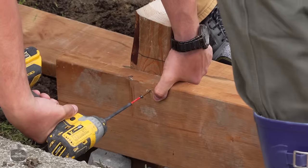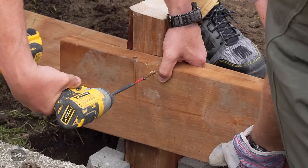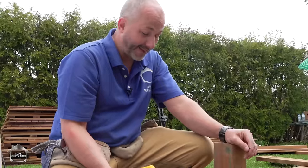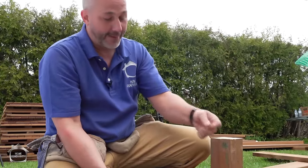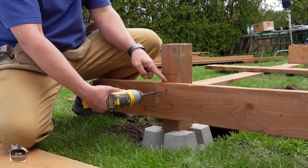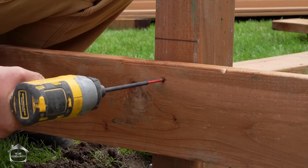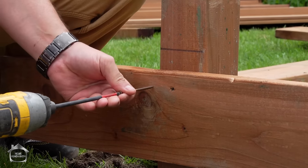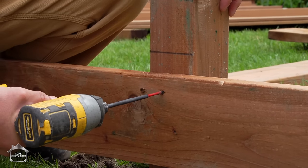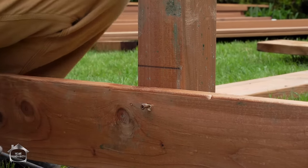All right. Let's lift it up. We'll lift it up, and we'll try to keep all of this square. So a lot of times when you're making adjustments with lumber, the screw head, which is wider than the shaft, gets in behind the fibers of the board. And when you're backing it out, it'll actually take the board off instead of the screw out. And it'll start opening this huge gap here. Well, that's not any good to you. So the way you fix that, throw another screw next to it and leave the head of that screw exposed. And that'll hold it in place while you pull the screw out. Okay? I'll just save that one for later.